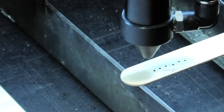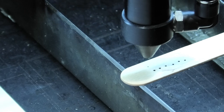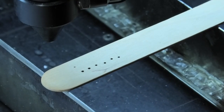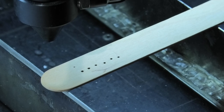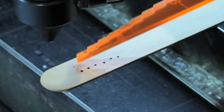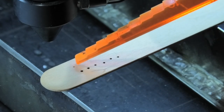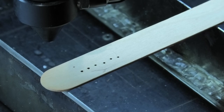The machine allows me to set, say, 10 milliseconds for a pulse. We've still got full power, but this time we've got the focus set at 8 millimeters. And I'm going to do a pulse. Whoa! Which is the correct focus? Because if all the light is passing through one small focal zone, why is that dot smaller than this dot? Because all the rays are passing through there or through there. They can't both be right.